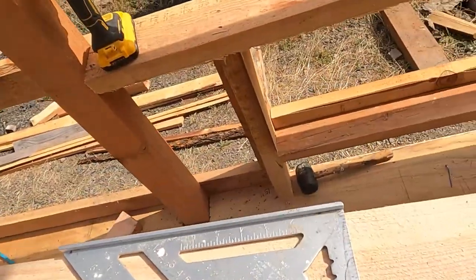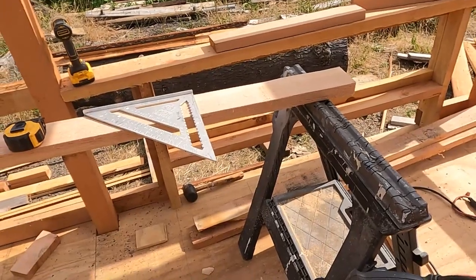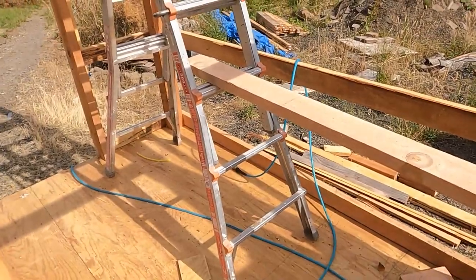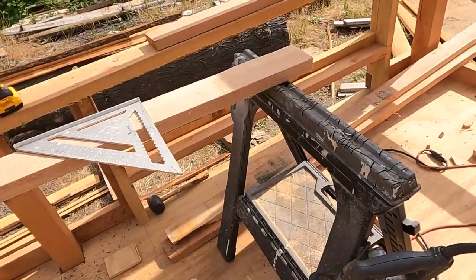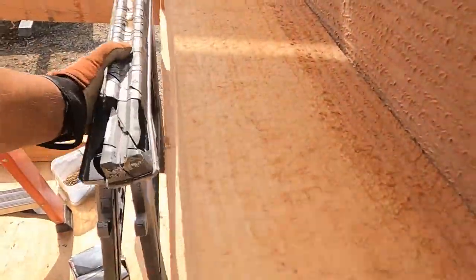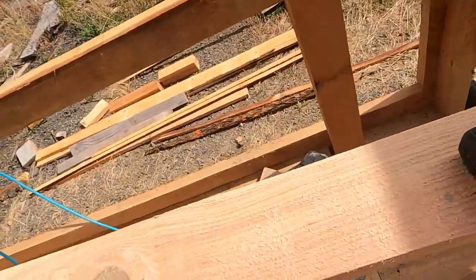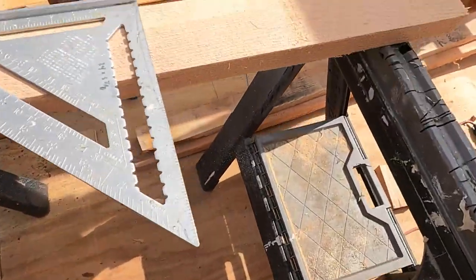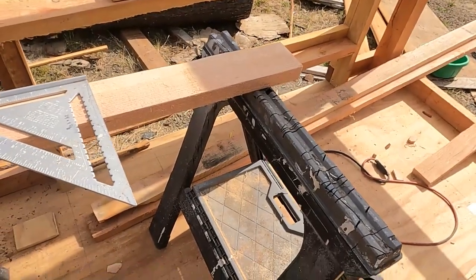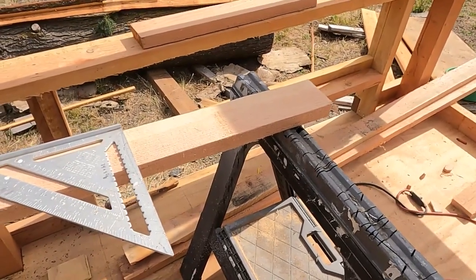Cutting them 27 inches long. Anytime you're working on stuff like this, you're cutting, you want a good, decent workstation. Now I'm using a ladder for one end there, and I'm using this old sawhorse for this end. And I probably should put this one. This is even a more beat up sawhorse. They've been through the war. But you want to have a good, decent work area, workstation. You don't want to be doing this on the ground, someplace where it's nothing stable and the board is moving.